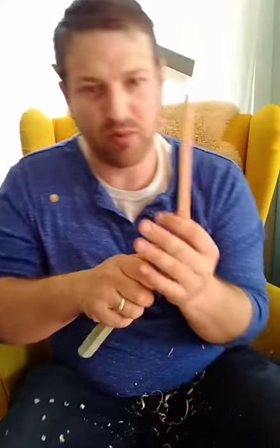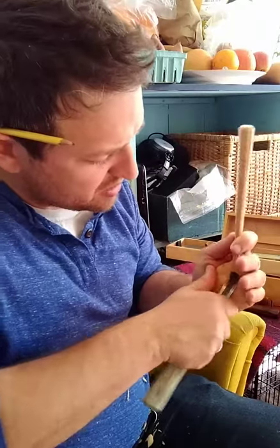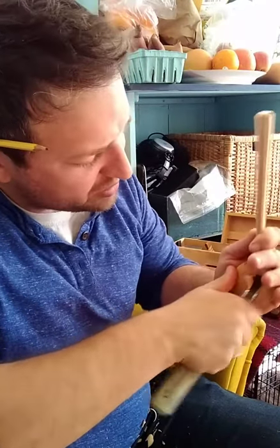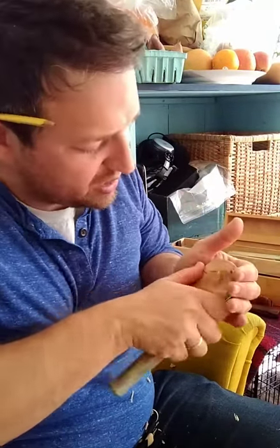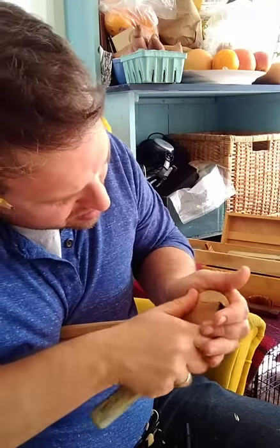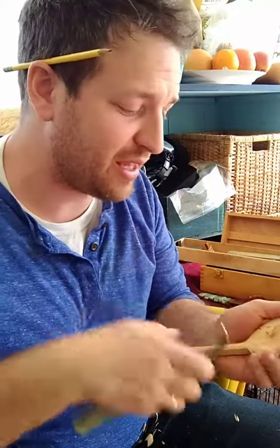I always like to support the spoon bowl in my hand like this. I start by keeping away from the edges and spiraling around and around, getting into the middle. I turn it around and when it's like this I tend to stick the end into my chest to keep it a little still, but I'm still supporting it in the palm of my hand and still coming into my thumb. Especially when you're just starting — if you had an adze, or sometimes people use the tip of their axe to chop up this middle bit a little bit — they're right that this is the hardest part to carve until you've established a curve that your knife is following.